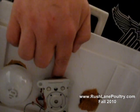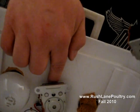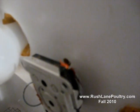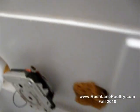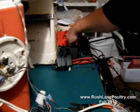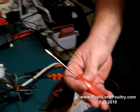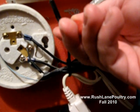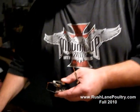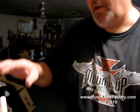Make sure you drill about a 3/8 inch hole — it's hard to see, but right where my finger is, where the adjustment is. That 3/8 inch hole goes into your adjustment screw so you can take a small screwdriver and stick it in to adjust the thermostat while it's closed. You don't have to open up your incubator to do your adjusting, which works great because you can leave the lid shut and not change the humidity while you fine-tune your incubator.